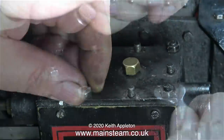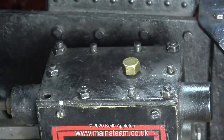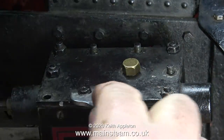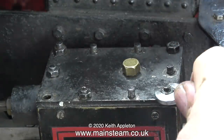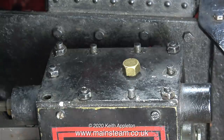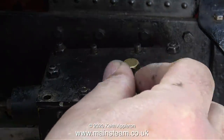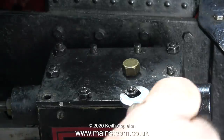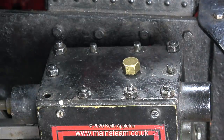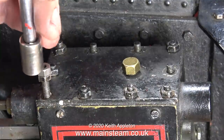At the moment I'm refitting the steam chest cover. For the studs that came out when I undid the nuts, I'm using the lock nut method to replace them. All you do is lock a couple of nuts on the end of the stud - that way the stud can be screwed all the way into the casting. Some of the studs ended up protruding slightly above the nuts, but that's not as bad as it was initially. To refit the studs and the nuts I used a socket, which made the job very simple because there's plenty of room to work on this locomotive in this area.